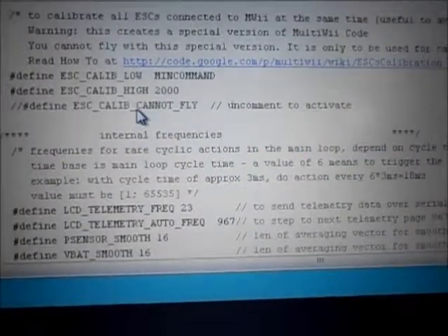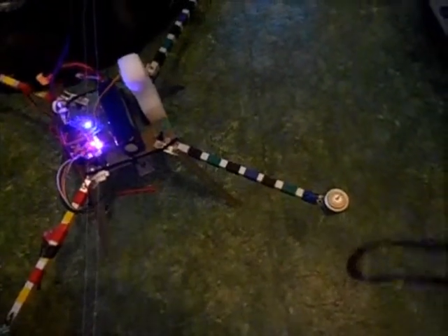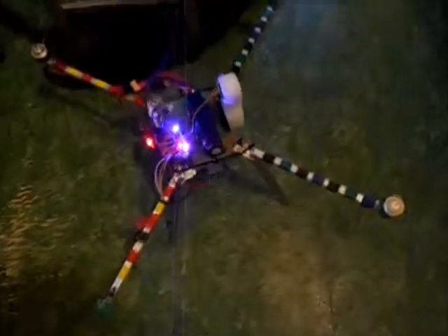After I changed everything I went back up to the top, hit compile, then hit upload, and it ran down through the USB port to the MultiWii which was sitting on the floor. It uploaded and updated all the firmware on it, and everything's been working right since. I got remote control, I got the radios functioning properly - throttle, yaw, every position change on the stick changes something on the motors. That was the secret: getting everything set right in Arduino. I got two out of the three working great, one of them sort of half-assed. I'm getting two more motors in the mail - I'm just going to replace that one and replace the one that got burnt up and see if we can't just get this thing to work.